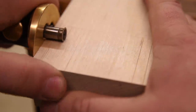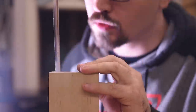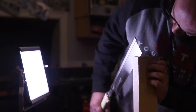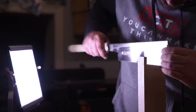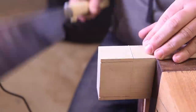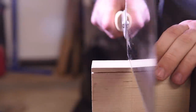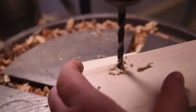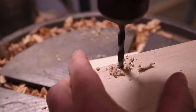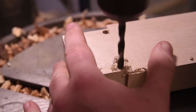I'm marking two sets of cut lines on these. I'm going to remove some material from the very edges to create a shoulder, and the other line farther inside will be for the wedge. The first cuts I made were the shoulders. Now these shoulders are actually very important, and that wasn't obvious to me. I practiced this joint in some scrap wood before building this because I've never done these type of joints before, and I didn't put shoulders on the practice piece. As I drove the wedges in, the wedges actually pulled the entire piece through the mortise because there weren't any shoulders there to catch the outside of the mortise and pull the joint tight. So you got to have shoulders.